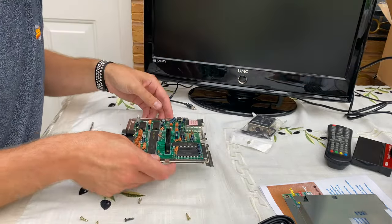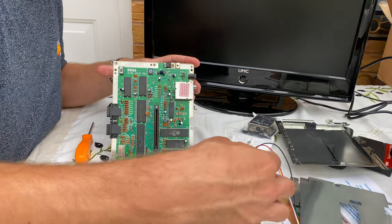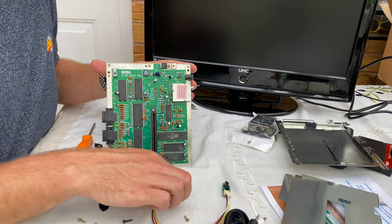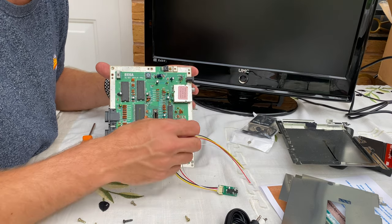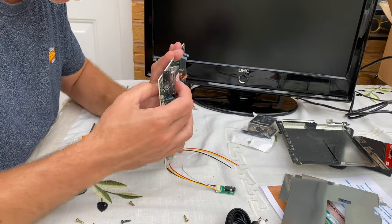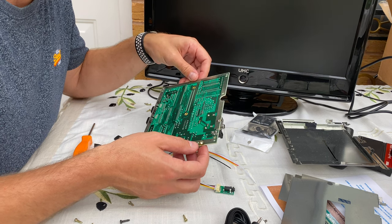So we can set that to one side and figure out what we're going to solder onto. This is the normal TV modulator and what we can do is take the inputs that go into it and replace them with what we've got here. You'll notice there are four wires, so I just need to find a ground. You can actually just desolder and take this TV modulator off — which looks like it'll just be those three connections plus some underneath — but if I can I'd rather keep the modulator on and work around it.